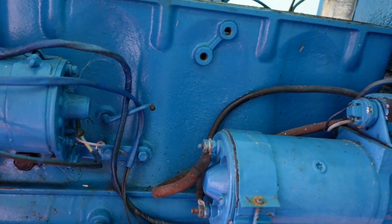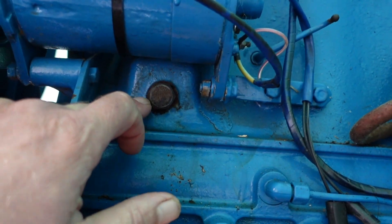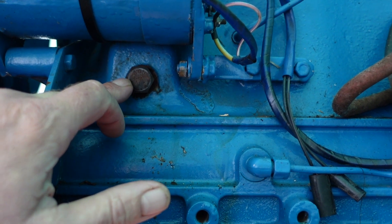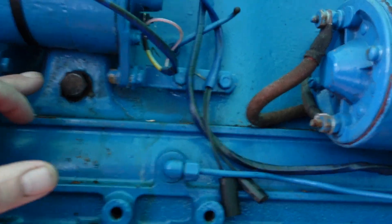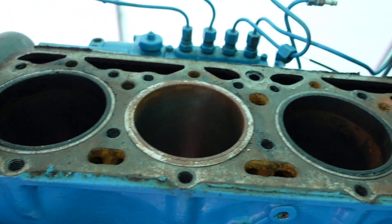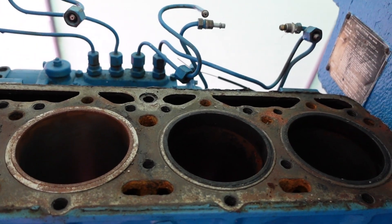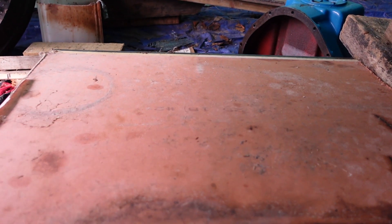We're back on the major. There was a brass tap whose threads into the block were not so good, so I've tapped it out a little bit bigger and put a bolt in with some silicone gasket sealer — hoping that's going to seal well. We've got the liners in, so what I'm going to do now is put some red cochineal food colouring in some water and put plenty in — not too much — and put cardboard underneath to monitor if we've got any leaks from the liners after getting them put back in. Hopefully we'll be watertight.